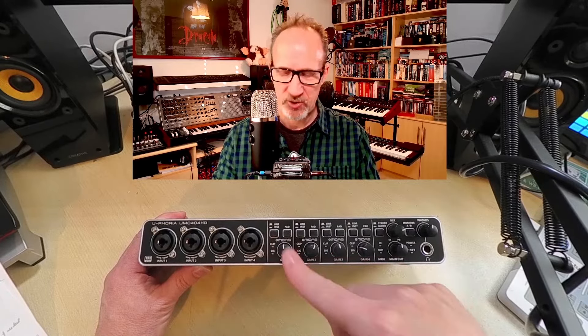Over on the right-hand side we've got a stereo/mono switch — does what it says, it reduces the signals from the input from stereo to mono if you want. We've got a mix button which mixes the sources coming in. For example, I have a mixer coming in to the audio interface for my hardware instruments, and my VSTs are coming in through the USB, and this mix gives me a blend between the VST signal from the computer and the hardware signal from the mixer — so I pretty much leave that set in the middle. There's then a main out knob controlling the volume from the main out on the back, a headphone volume knob and headphone socket, and a MIDI in and out indicator so you can see whether MIDI signals are being received. A pretty comprehensive front panel with everything you need.